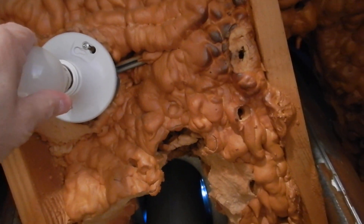We shouldn't have bare light bulbs in clothes closets, garages, and mechanical closets. We're seeing daylight around the flues — if daylight can get in, water can get in.